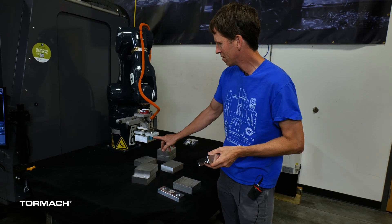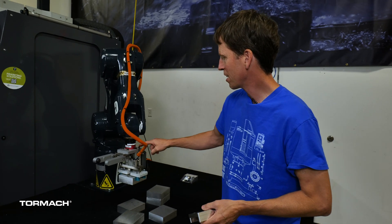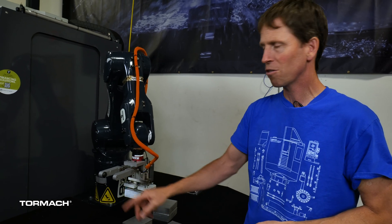Thank you so much for watching this overview. Coming up next will be a video talking about how we programmed the probing routines in the mill — specifically how we used those routines to set G54 and G55 offsets for the mill and for the robot's flipping gripper. The robot actually uses that G54 offset when it picks the part up, so it always grabs it perfectly in the registration hole. Then we'll talk about the LiDAR system, and finally we'll do the video on 3D printing the end-of-arm tooling. Everything on the end-of-arm tooling — whether it's the gripper fingers, the tooling plate itself, or the flipping fingers — is all 3D printed.